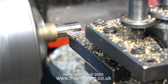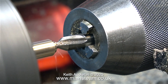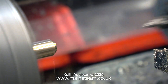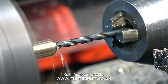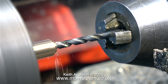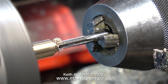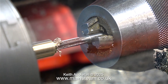The diameter is now turned to the right size to fit into the bracket, leaving sufficient room for some Loctite to hold it in place. When using Loctite, if you turn the parts to too close a fit, then the Loctite will be squeezed out and will be ineffective. As usual I've centre-drilled the work; now I'm going through with the drill size, which is one imperial size less than 3/16ths — that's the finished diameter I want. Here is the reamer that I'm putting through; the lathe is now in back gear going a lot slower, and this is a 3/16ths reamer which will get a good finish inside the bearing.